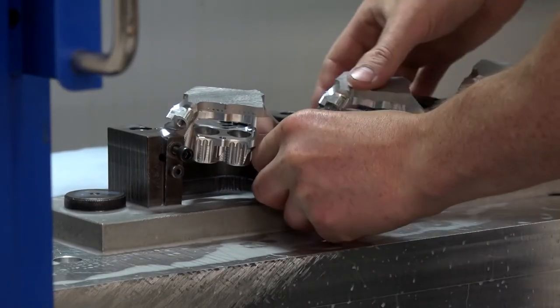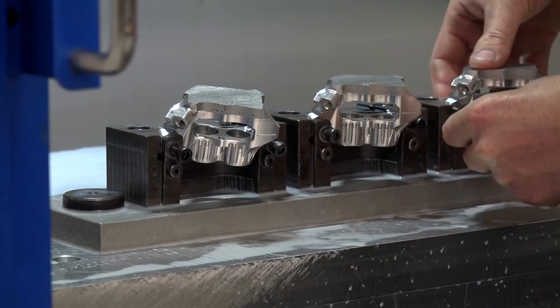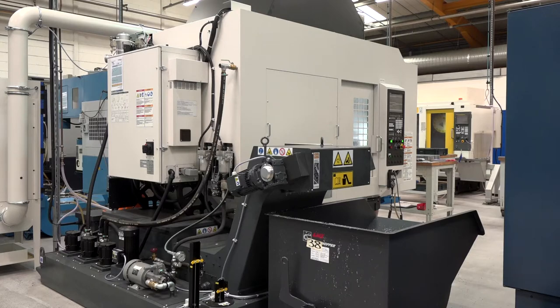There's also a big discussion that happens commonly about BT40 machines versus BT30. You embrace both technologies here but are starting to lean towards the 30 taper as a solution. Why is that? Well, a lot of the parts we make are quite small, so we're not removing huge amounts of metal — it's a lot better for us. We still use BT40 for bigger operations. But the BT30 machine is also a lot smaller, so you can get more machines in a smaller area. Yeah, we already use quite a few different BT30 machines, so it was just a natural progression.